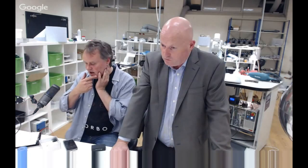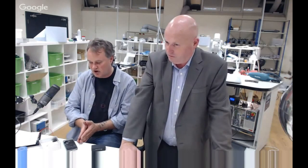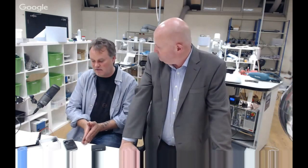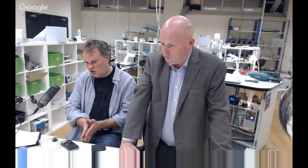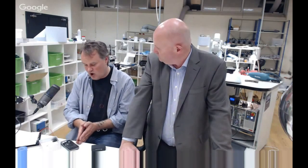The reason that we need a lithium battery is, if you look at any consumer electronics product, the amount of power it draws varies dramatically during the day. When you're on the phone, you'll be drawing a couple of watts. Now, if you build a battery that directly connects and has to meet that couple of watts requirement, you end up with a very, very big battery.